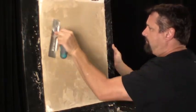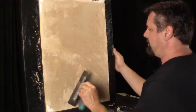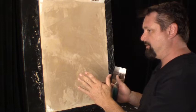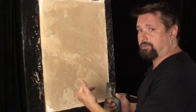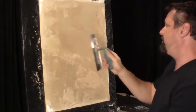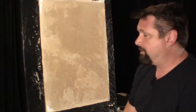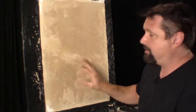I love lime. Acrylic just doesn't feel or look this way — it's very luxurious. There are so many different finishing options. You can leave it natural with no wax and it's going to be water-resistant, but it's not going to be stain-resistant. If you put this in a dining room or kitchen and somebody spills red wine, grape juice, or soda, it's going to stain. If you cook with grease and it splashes up, you're going to see that. So make sure you keep all that in mind.